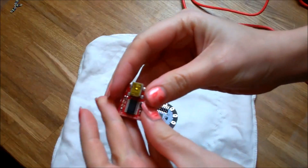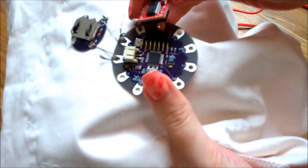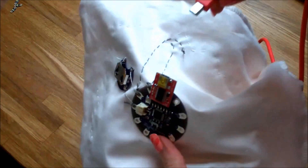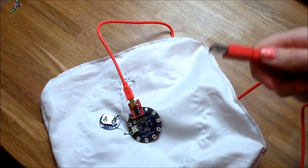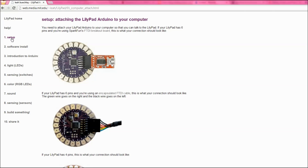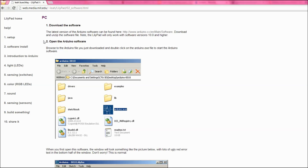I've finished sewing my LilyPad LED. Now it's really important to test that it works before I sew all of the others. So I'm going to use the breakout board that comes with my kit, plug it into the LilyPad board, and then use a mini USB cable to plug it into my PC, where I can install the drivers and download some software to program my LilyPad. There are some great websites online that give you information about how to get started using a LilyPad, and I'll put links to these in the description and in my blog post that accompanies this video.